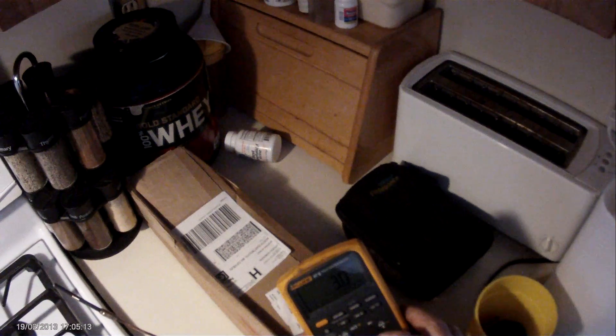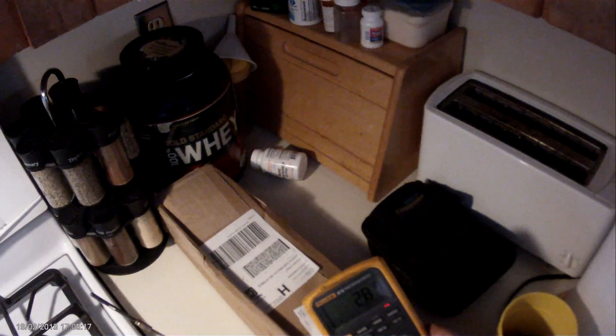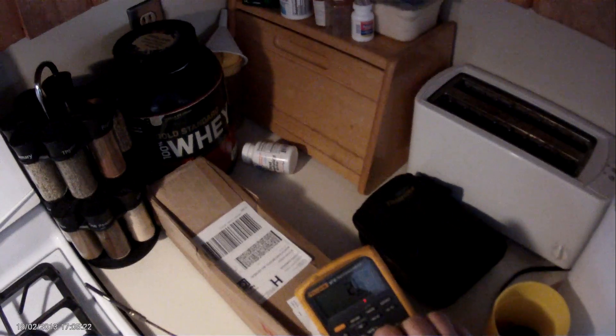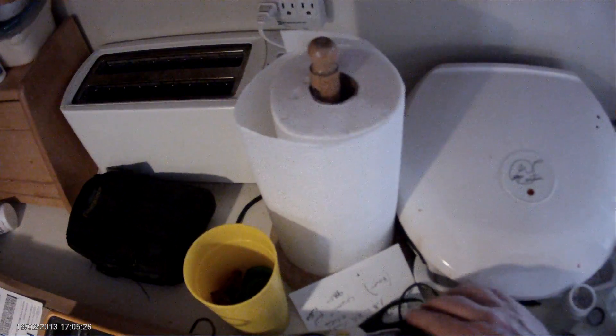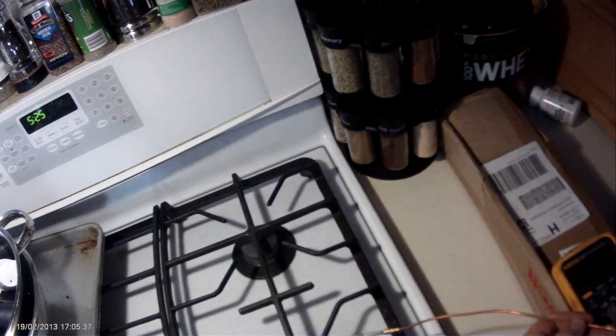Okay, so that's good — let's see what we are on millivolts. See, we're down to 3-4, so that would have shut the gas valve off — it wouldn't let anything go through. These things produce millivolts. So here's how you check it: put the red on there and the black on the end. If that's in the heat, it will create millivolts, it will expand, and tell the gas valve okay, you're ready to operate. Very simple.